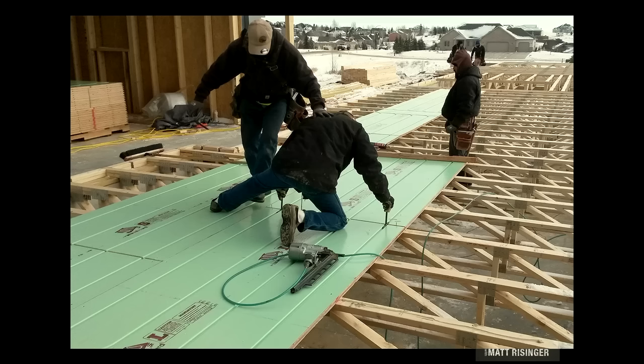We've done close to 40 million square feet of radiant heat in North America, so we're kind of a big deal in the radiant heat business. As you can see from this picture, you take this four-by-eight panel — he's got a skill saw there and a nail gun. It cuts like with a skill saw and nails with a nail gun. It goes right onto joists — these are trusses actually, but that's a form of a joist system.